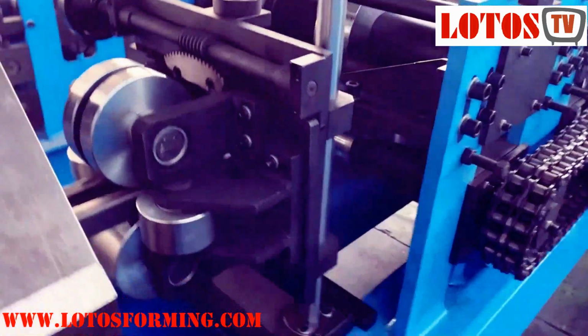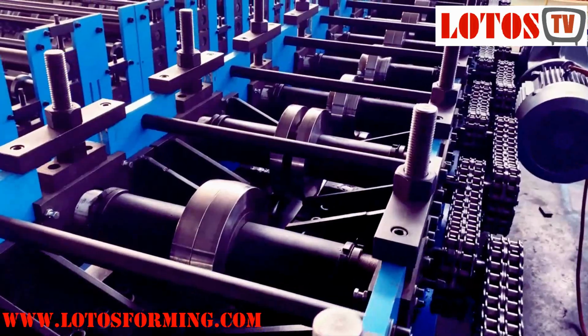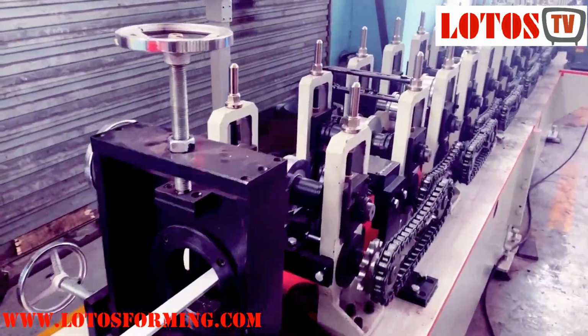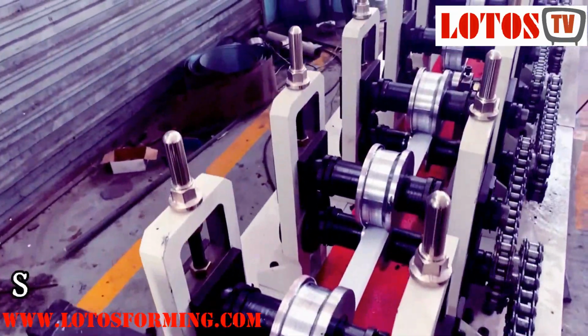Roll-forming transmission types. Chain drives. Using one chain to drive both the top and bottom shaft, but the shaft adjustability is very limited and the speed is very slow. An alternative method of chain drive allows big vertical adjustability of the top shaft. Chain drives are for a low-cost roll-forming mill.